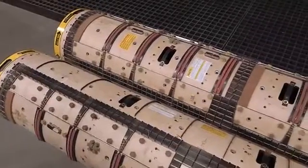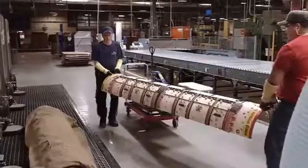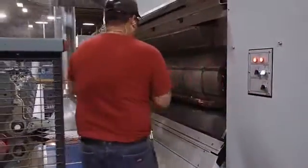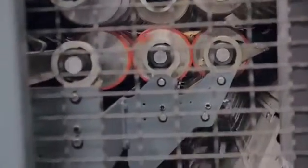The cutters are built from two half cylinders with metal blades embedded, as well as foam rubber sections to eject the cut board scrap pieces. Scrap is recaptured and recycled back to a paper mill to be used in future roll stock production.